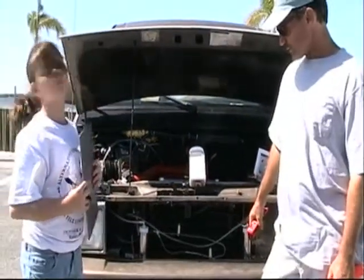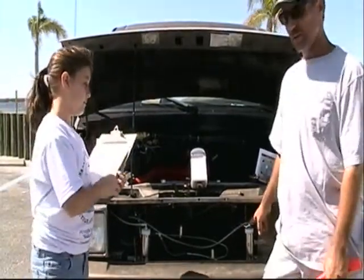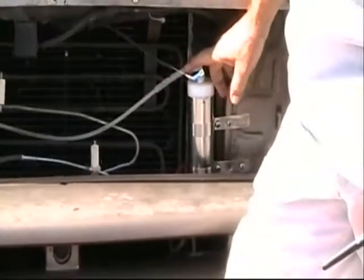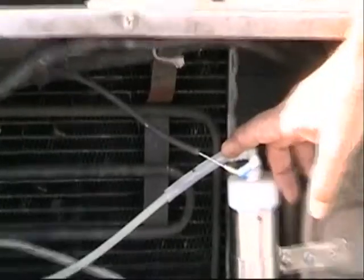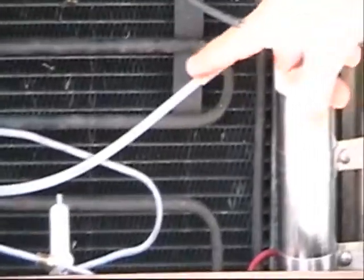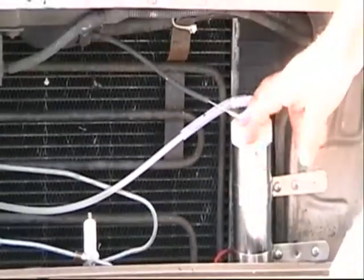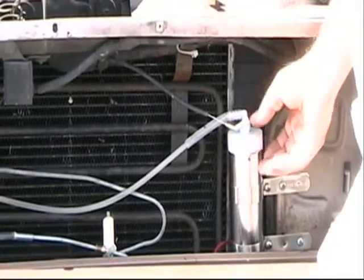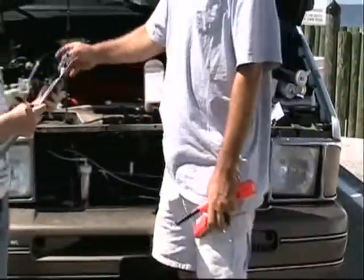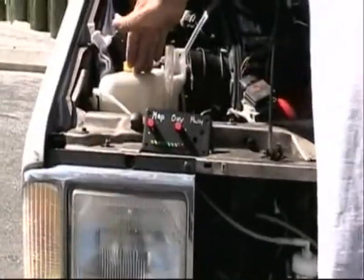They are a full bath cell, which means that they're always full of water all the way to the top. If you can zoom in on this, you'll see that the output is pushing water with the hydrogen and oxygen through the tube. There's no pump installed — that's what we call an ion pump. It's actual gas rising that pushes water out with it. And that water gets pushed over here to the bubbler, which is also a reservoir.